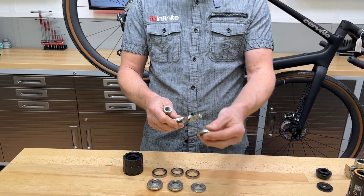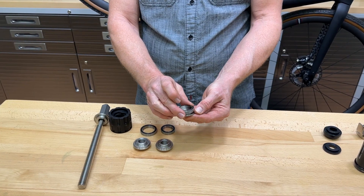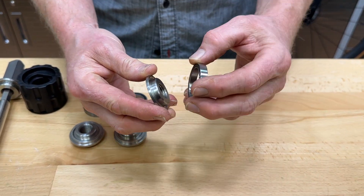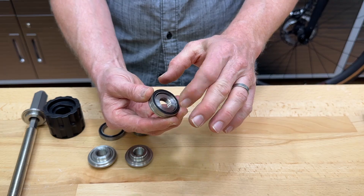You can install the dies very easily by going in from the strike nut end. The 40-30 bearing is going to interface with that just like that. Notice how this is only touching the outer race of the bearing. There's an undercut in here for a good purpose, because we never want to push on the inner race of the bearing.